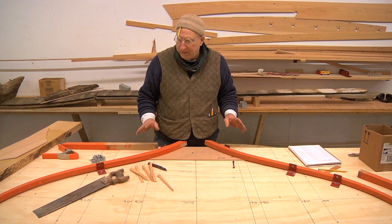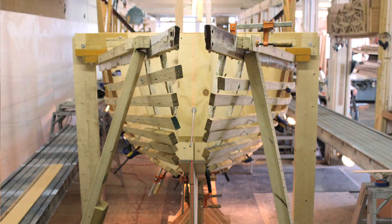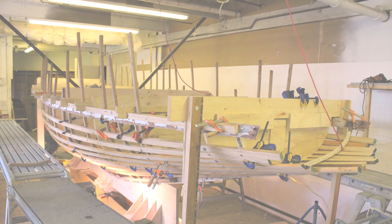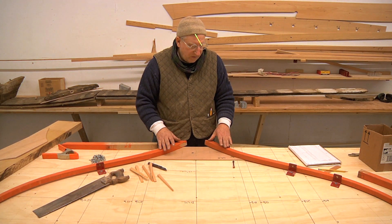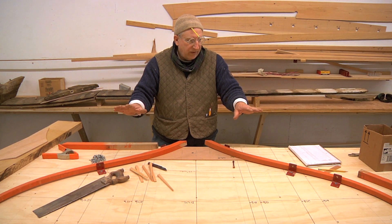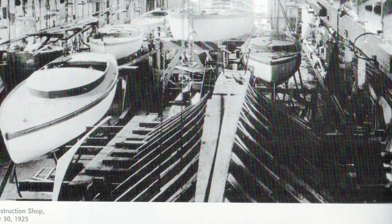We're ready for the assembly of the frames and the floor. This is a very precise part of what we're doing, in that we want the shape that was carved into the model to go into the boat at this stage of construction. So we take the two frames, we have a very exact layout of waterlines and heights to which we'll cut the floor, bolt it in place, put any temporary bracing that's needed, and be able to set that in the boat. A hundred years ago, those offsets would be used to build full-scale molds, and the frames would be bent around the molds with the planking screwed to the frames.